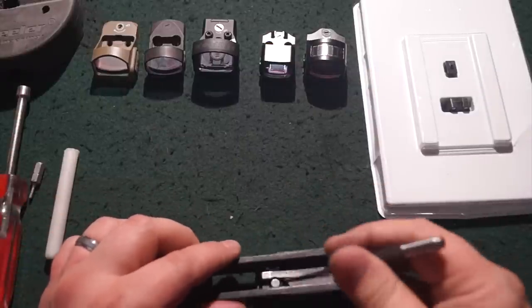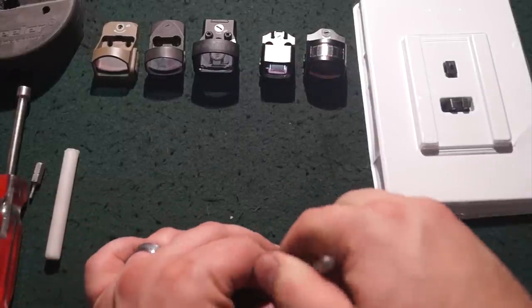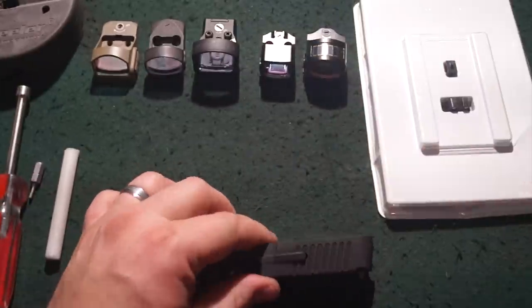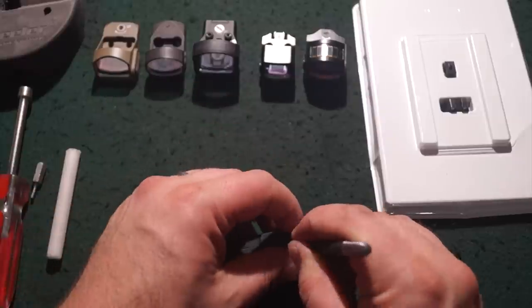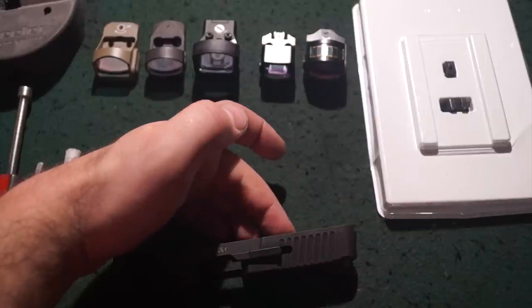The extractor has a couple of different pieces here. What we're going to do is press in on the lowest one. See if we can get this, once again, working behind the camera. Press in on the lowest one. We should be able to slide that over just enough to where it has a little bit of a crack right here. You can see a little bit of a gap. At that point, you can usually put a couple fingers over here on this side and push this apart. And what it'll do is it'll pop out and you won't lose any of the other parts.